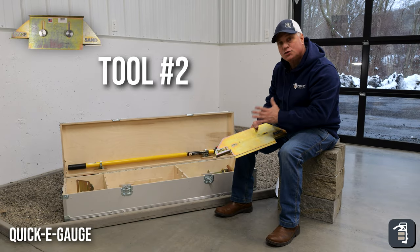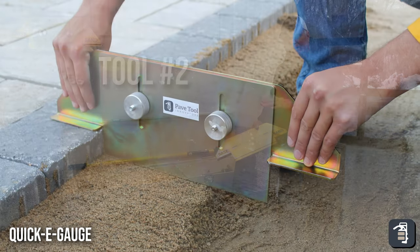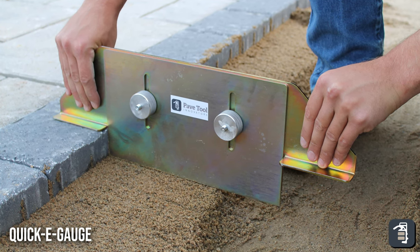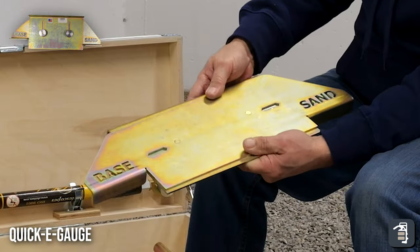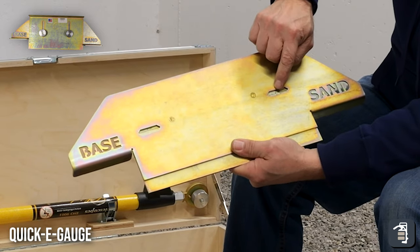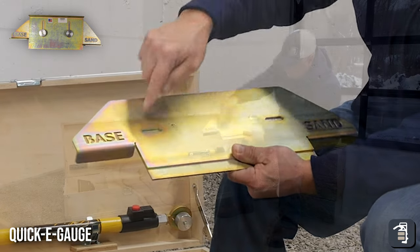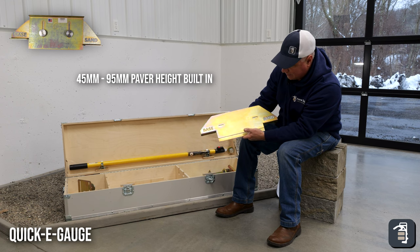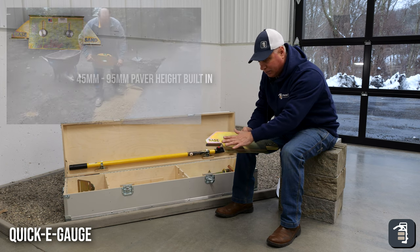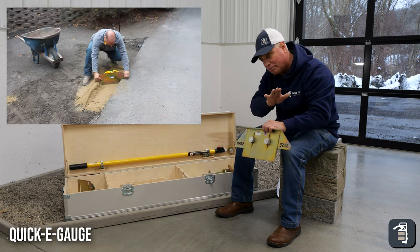This particular tool is called our gauge. We created this for anytime you're butting pavers up against a fixed edge — a great example would be a pool patio. You have to get your base, your sand, everything at exact height around that pool patio to look professional. It has knobs in back — you loosen up and adjust the face plate. Within this face plate we built in the height of the paver in millimeters, so for a 60-millimeter paver, I tighten it to 60 mil. It goes from 45 to 95 millimeters, calibrated using one-inch screed rails. Set it on a pool coping, get your gravel in front of the unit and strike it off — that's going to get your base perfect.